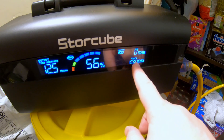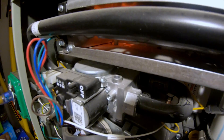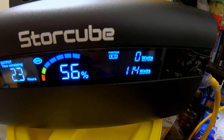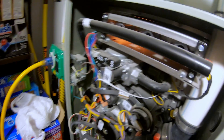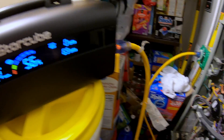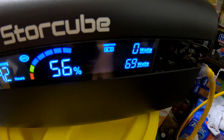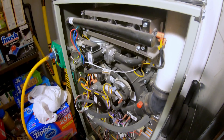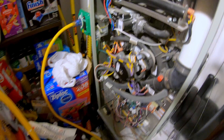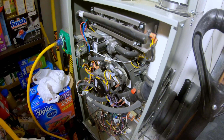Right now in its idle state it's pulling 28 watts. The induced draft has started. Then the hot surface igniter comes on — with that running we're pulling about 114 watts. With just the induced draft running and no indoor fan, we're only pulling about 69–70 watts. The fan is ramping up and then stopping — something strange is happening. Unfortunately this power station is unable to run at least my particular furnace.